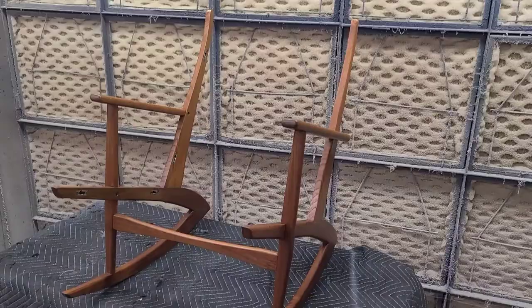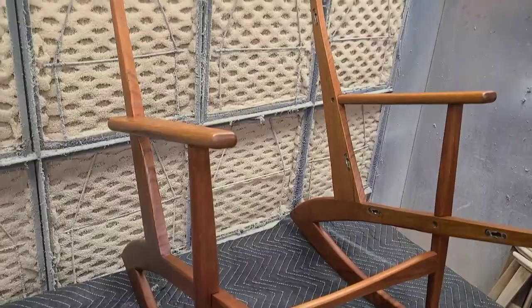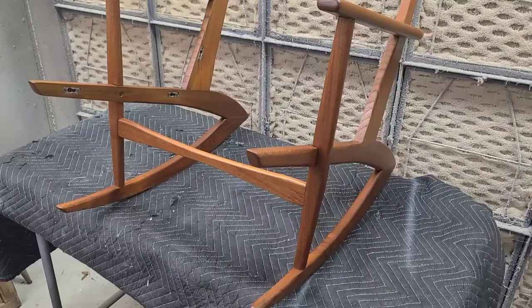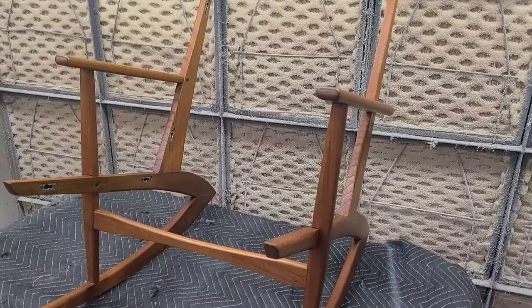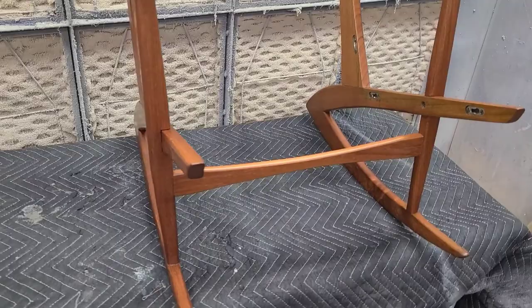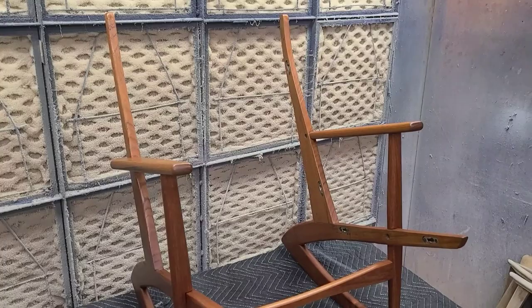After the wool lube rub-down, what I love is how it dulls the finish to a nice vintage look. When you re-oil pieces they can either look too raw and dry or overly finished and too new. This process gives a great in-between result. It's a shame the upholstered inserts aren't here yet to show the truly finished piece, but you can get a great sense of it. The panels will go in and it'll really come together. Thanks for watching — subscribe and good luck with your restoration projects.